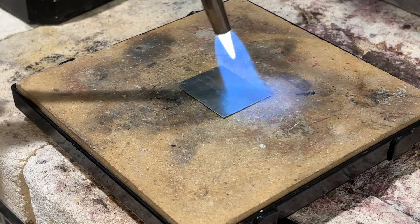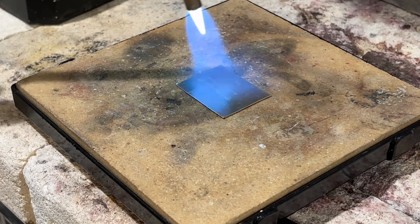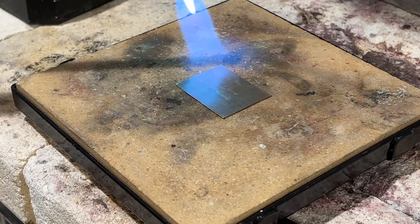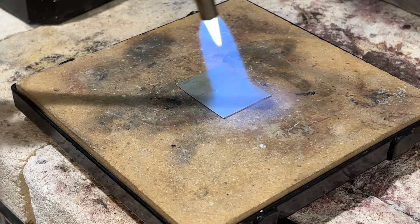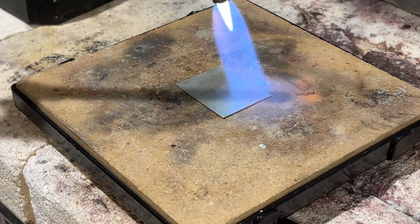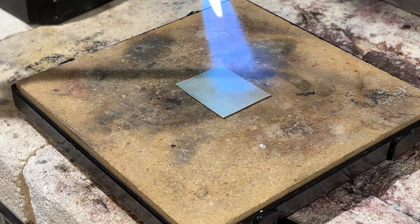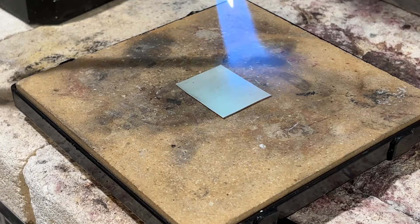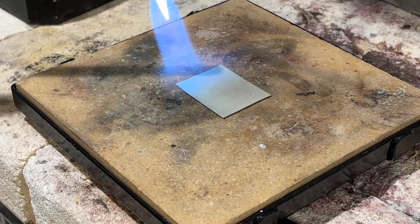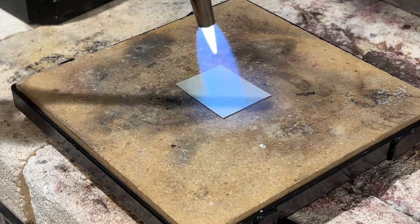So let's get right into it. To start with, it's very important to have a very clean surface that you're going to do the torch heating of your piece with, to make sure that you don't have any other solder or flux on that surface that can contaminate your metal while you're warming it. You want to have a nice neutral flame and just heat the piece slowly and evenly, occasionally moving the torch flame off of the piece to let any copper that is in the surface of the metal oxidize a bit, and you'll see that as dark little spots or areas. You can just see here, I'm evenly heating it.